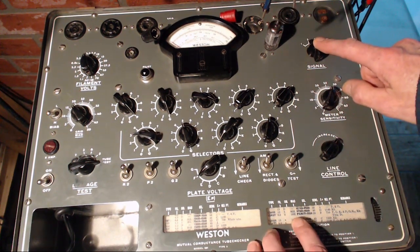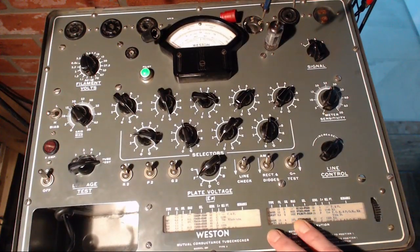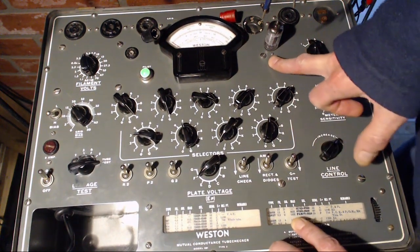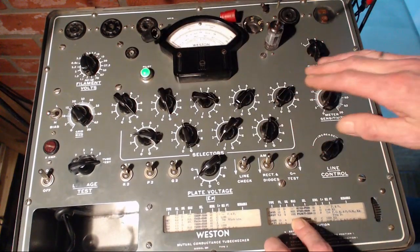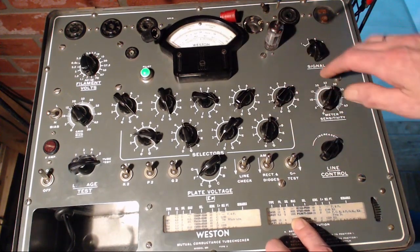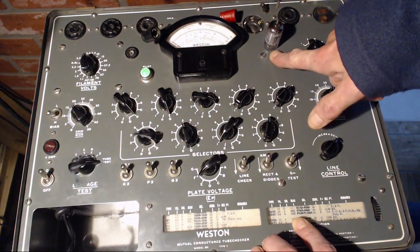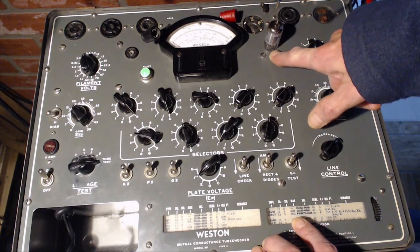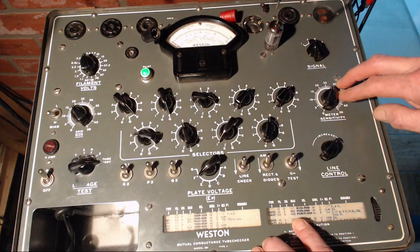Let's just do a quick check here. Sure it is. Okay, switch on. Now, even though this is a 12 volt tube, in this tester it's tested at 6 volts. So it must be running the two heaters in parallel here, as opposed to series for 12 volts. It's probably why this tube can work in the receiver also. Most of the tubes are 6 volt tubes, so this must be powered with 6 volts. Got it?